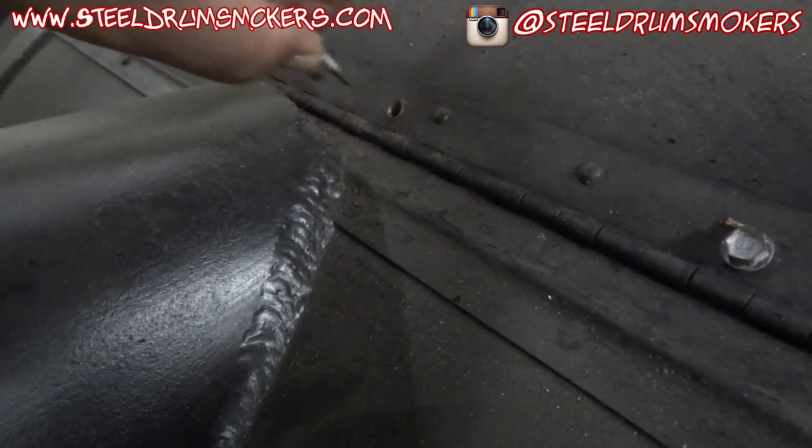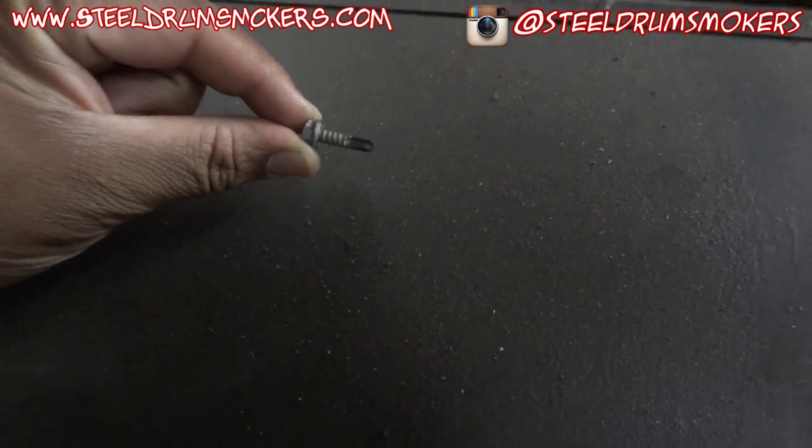When Kirk made the smoker he put a piano hinge on here and he spot welded each of the places where the piano hinge was. The piano hinge was failing, so I tried to use some three-quarter inch self-tapping sheet metal screws, but the problem is they're not long enough. What's happened is the sheet metal screws have just grabbed onto the sheet metal from the tank and held on to it, but didn't actually go through this piece of angle here.